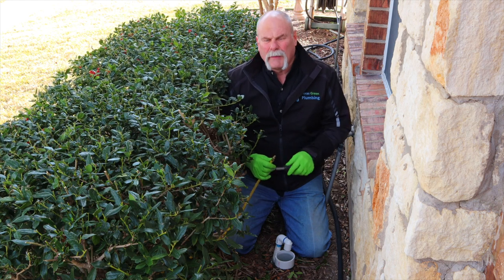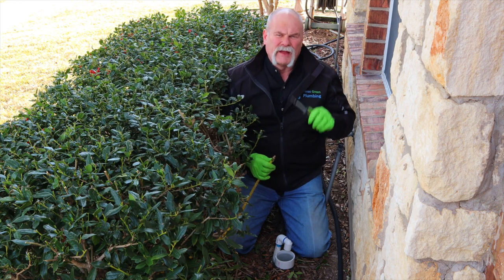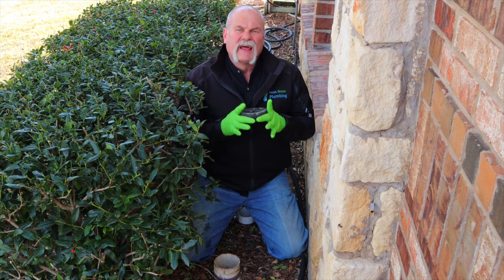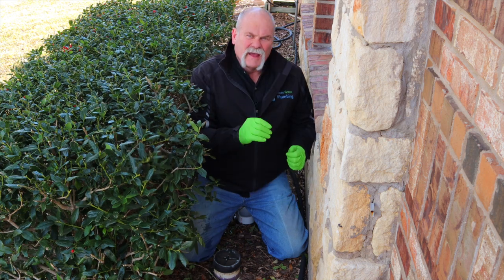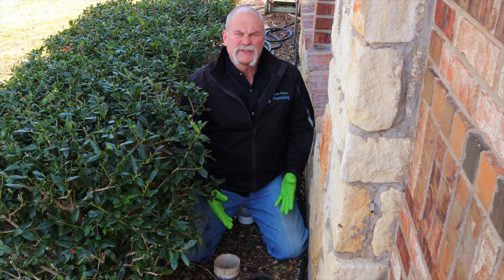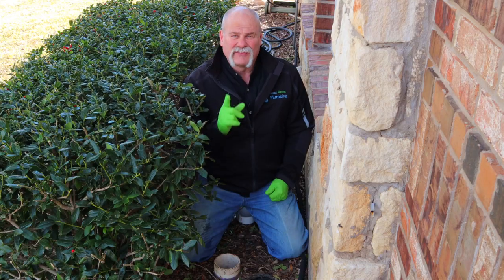I put a test ball in here and did not apply any external pressure to the sewer line at all — not even the water line. That's why we do not call this a hydrostatic test. At Texas Green Plumbing we call it a sewer water test. Also, if you have rubber gem caps like this, I recommend leaving the stainless steel hose clamp off — just set them on, not too tight. If anything ever stops up, a little bit of pressure will push those caps right off instead of backing up and flooding inside your house. You may have a mess outside, but you won't be cleaning toilet paper and waste out of your carpet. Much better deal.